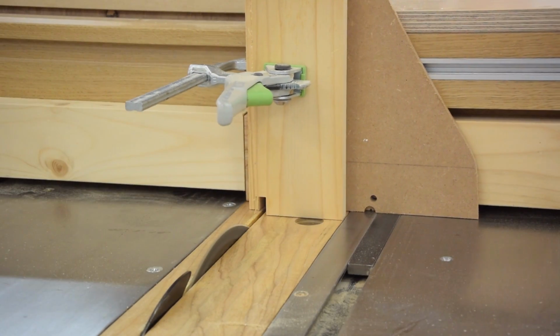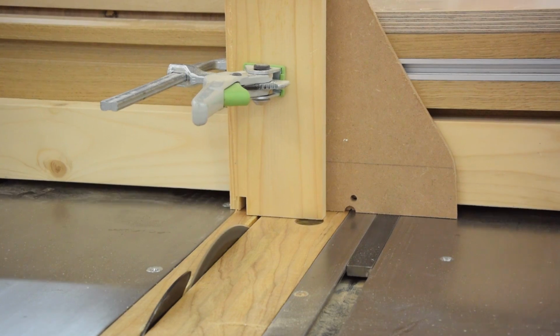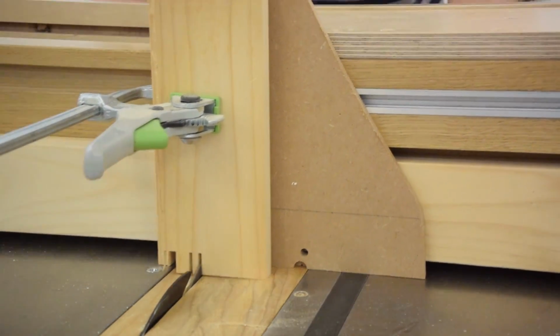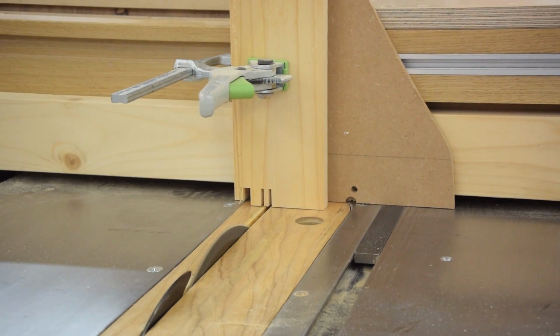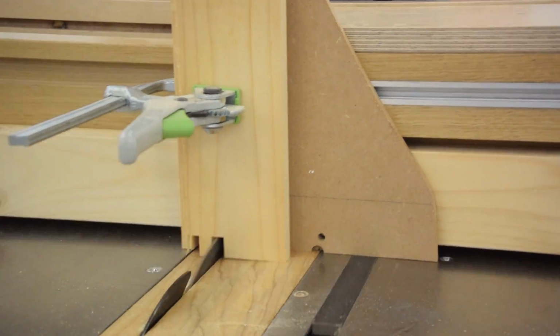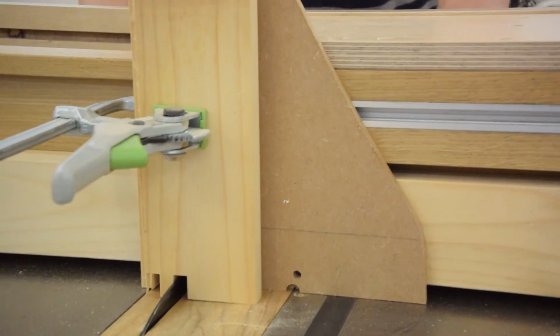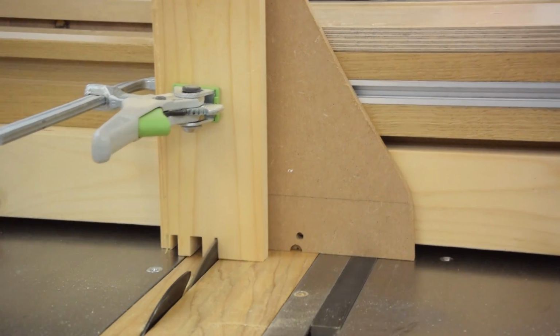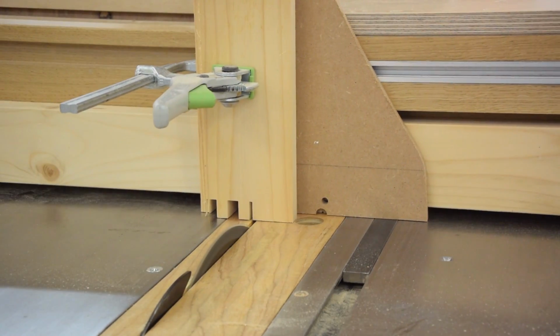The sides of the fingers are cut first to avoid the blade getting deflected by only partially cutting on its edge. Then the jig goes in reverse and hogs out all the material. These hogging cuts overlap a little bit, which creates a very clean bottom between the fingers.